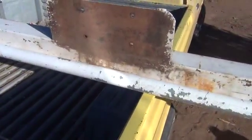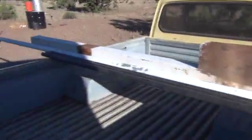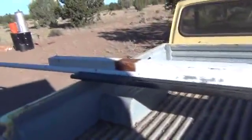This is a square stock chunk from the bumper of an RV or trailer that I tore off. That's going to give us a nice big chunk of square stock. We've got two 20-foot sections of that white pipe there. Each section is going to be cut into four five-foot long chunks. Those will weld into the square stock here. We've got our black iron pipe here, which we'll use later in the project. The first step is to mark that big square stock piece into four even sections and cut those out. I'm also going to cut one of those 20-foot pipes into four even sections, and we're going to weld together one side of this condenser radiator system.